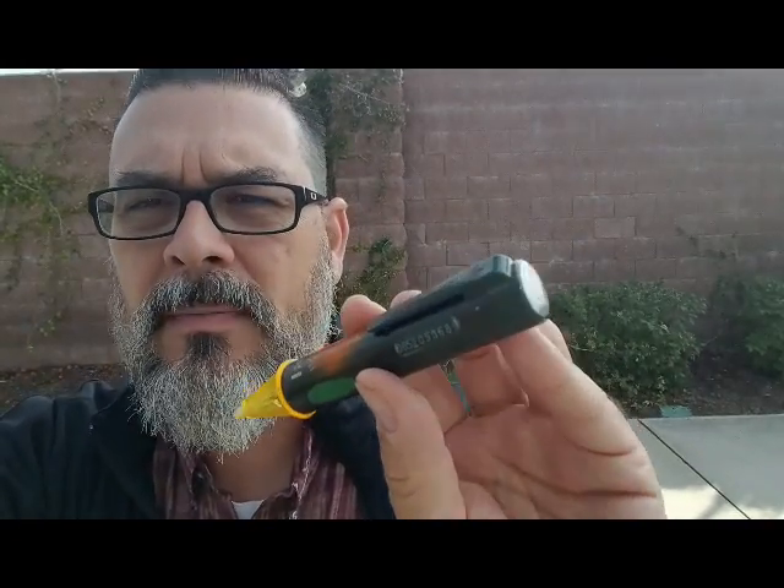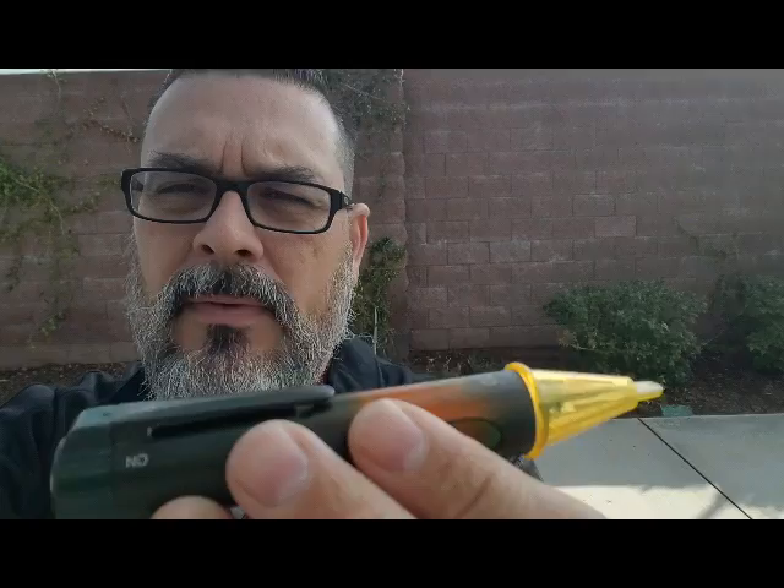It is a non-contact voltage tester — it tests for voltage but it doesn't tell you how much voltage. When we say non-contact, it means there's just a plastic tip here with no metal parts, so you don't have to actually touch the metal conductor, any metal bussing, or any current-carrying conductor in the circuit for this to operate. It doesn't have to touch anything. You can have it spaced away from the wire or the circuit, and you can also touch the insulation on a wire and it will give you an indication of electricity. That's what makes it non-contact. It's just designed to let you know if there's electricity or not.